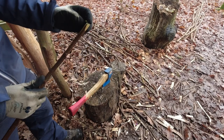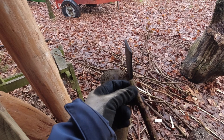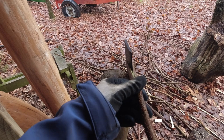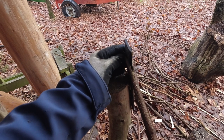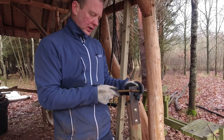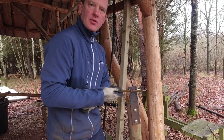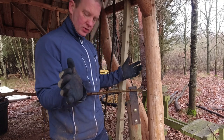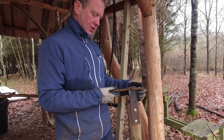Nice and steady — so you start the split off in the rod with the axe. Now this is where it gets interesting: we need your riving post. You've got your start of a split in your rod and you pop it in there. I'm holding this with my right hand steadying the rod, left hand on this — that's how you start the split. You want your hand quite close up to the post; you don't want your hand back here because you'll have no control. I've got my elbow tucking the rod in against my ribcage.